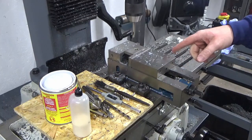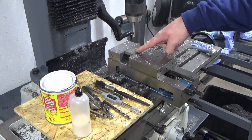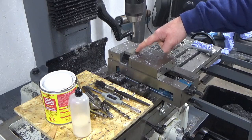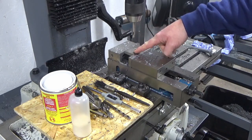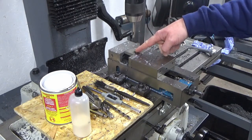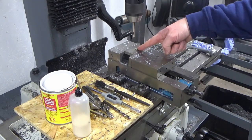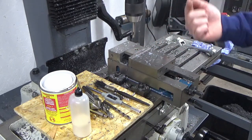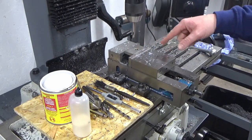Right, guys, we're making this up as we go along again now. I've had a quick measure with the rule, and we're going to pop a 6.5mm hole in this sole plate as a clearance hole. I'm putting it on the same centre line as the tapped hole, kind of halfway between the small tapped hole and the big one. It doesn't matter on this plate because there's loads of room, but on the underside of the other plate, I've obviously got both holes in play. So that will clear both nicely.